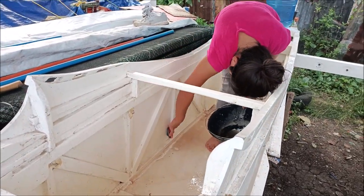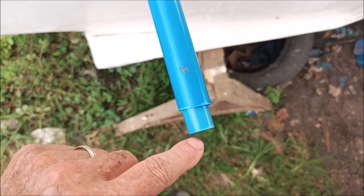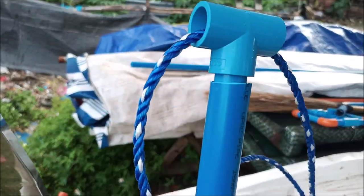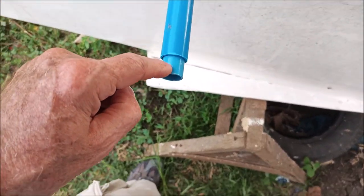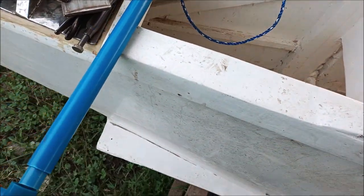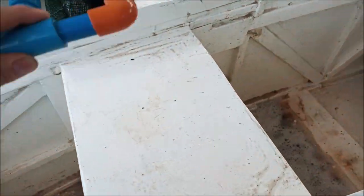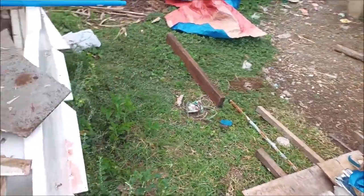So anyway, we're pressing on. I've got these things done. You see, I put the 3/4 inch sleeve over the half inch and glued it in place here. So now we have a stronger pipe. This is the thickness of the half and the 3/4 here. And this recess part has to be that size, because it goes into this half inch piece here. This is the foot thing, so it sits in there like that. I had to leave that small, but anyway, it's a perfect fit. So we're good to go with this one, and I did this one here too.